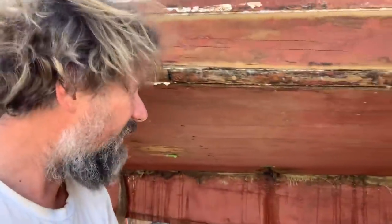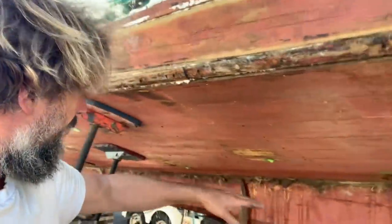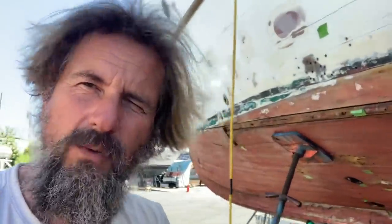The boat is definitely dried out — when I first reefed those seams out they were tight, so it's not that there's a structural gap, it's just that it's dry. Back here you can see it's holding water now generally, and this is going to work really well. I just need to get back under to do a little more caulking and tighten it up.